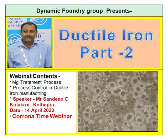It depends on your bath sulfur, your last heat's residual magnesium, your tapping temperature. There are a few elements on which it depends. You have to take a call before you decide how much covering you are going to use. You just see last heat's microstructure, last heat's residual magnesium, whether it is in control or not, whether it is in range or not. You see this heat's particular bath sulfur, what is that, what is your tapping temperature, and based on all these three things you can decide whether you can keep the same covering or you have to increase the covering.